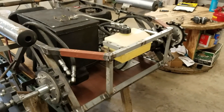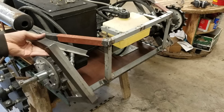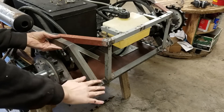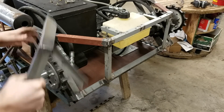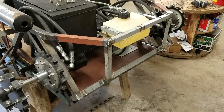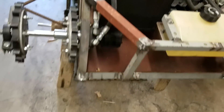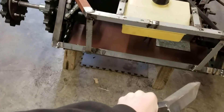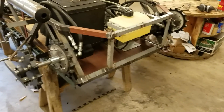I'll start here at the back. As you can see, I completely rebuilt the back profile of the tank — it looks completely different now. The way it was before, the frame came back to a point because that's how the original tank I was going to make looked. After I changed my mind, that just wouldn't work; it was much too different from what I wanted. So I cut the frame up there, cut it off down there, cut off the support that was on there, welded on these two pieces of angle iron — those two red ones — to give it a taper coming back, connected that in the middle, and put a big piece along the bottom running the whole length with a couple supports. That's what it's like now — it looks much better and I'm really happy with how it turned out.